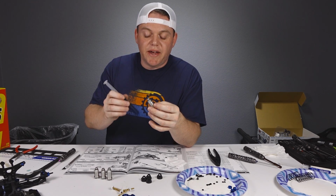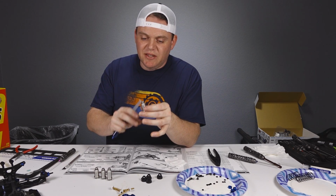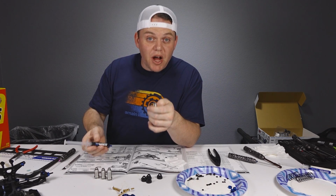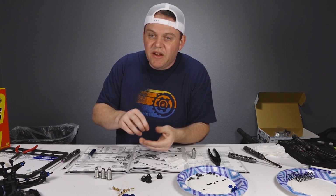When building the bottom shock area, there's a lot of O-rings and different pieces that go in here, and they're really sensitive pieces for the shock. So something that's really important to do is lubricate those parts. I'm going to use Premier Blue. You can use shock fluid also if you want to. Our little silicone O-rings like this, we definitely want to.